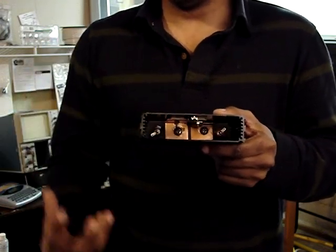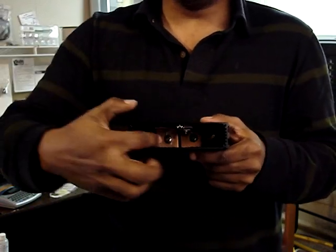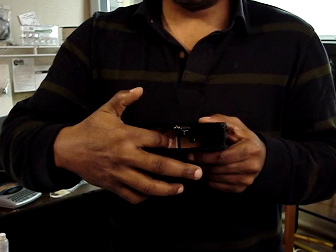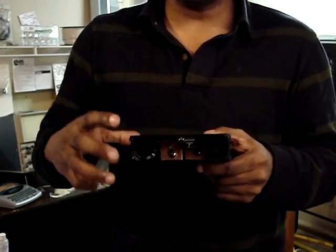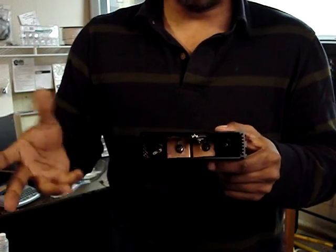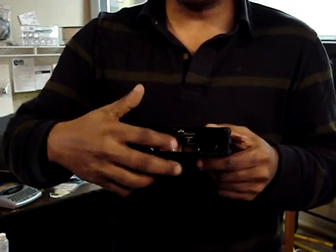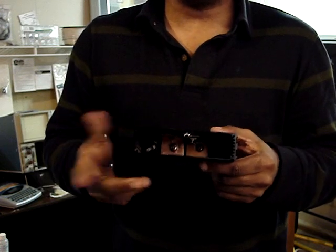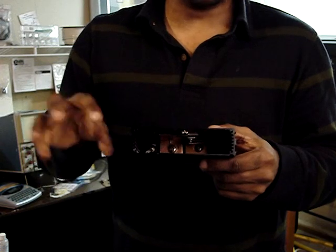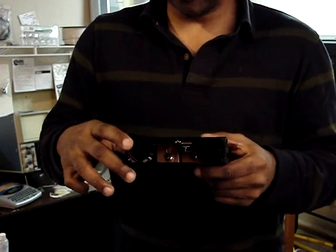You'll need three-ounce copper on the bottom and three-ounce on the top. This copper in here is separate from the circuit board — we actually fabricated it with a brake. This is 24-gauge copper, which is actually the equivalent of using 20-ounce copper on a circuit board. So it's capable of handling a very high rated current.